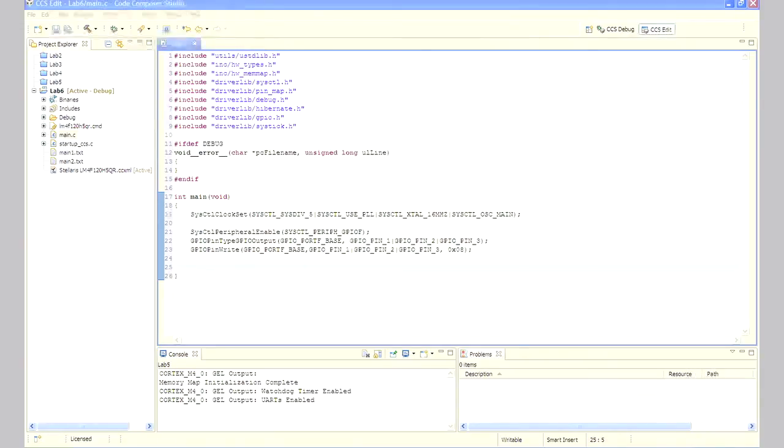Line 5, we're going to set the wake condition to the wake pin. So you can see hibernate, wake, set. It says hibernate, wake pin. So that's what we'll wake on. In line 6, we're going to turn off the green LED right before the device goes to sleep.